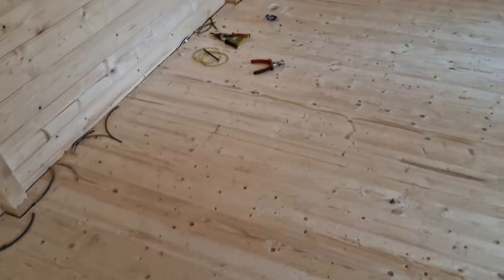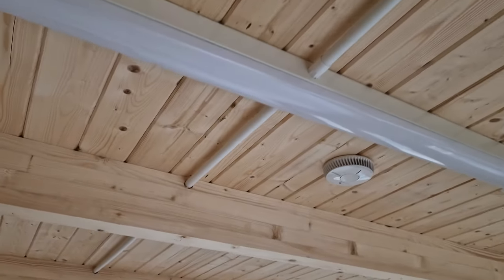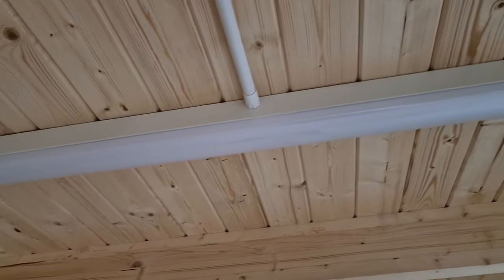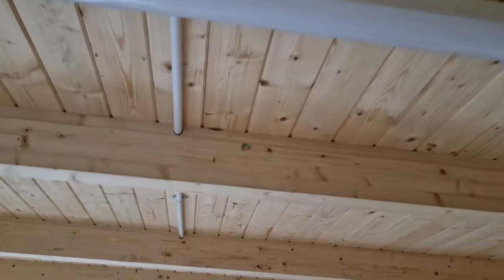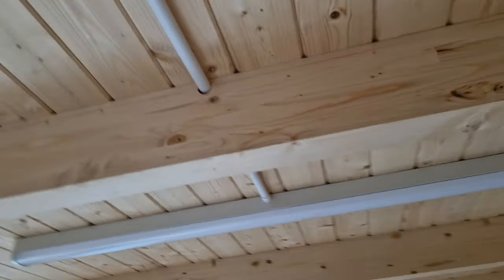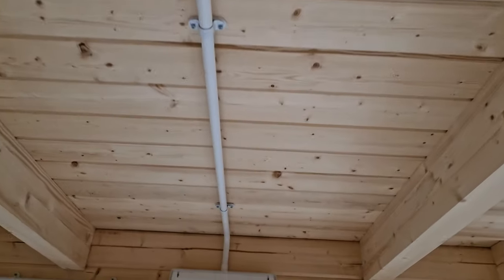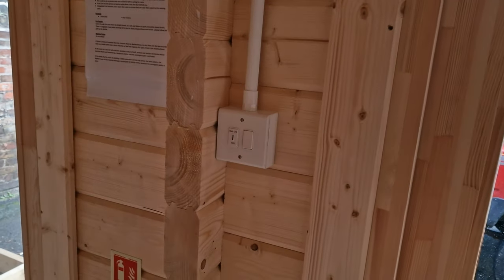The lighting, as I say, is conduit. And we've got conduit coming across the ceiling to a first or middle light. And then I had to drill really carefully through the beams to get the conduit through, or miss a saddle, to the light on one side, and then again go through that side. I did put the saddle in that one, to that light. So there's three lights in here, and if we go back to the centre, there's a conduit coming out of that end to an emergency light, and then along and down to a light switch.